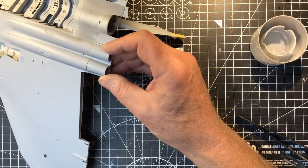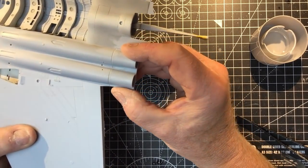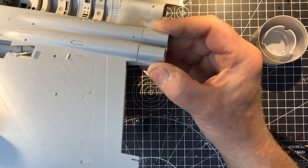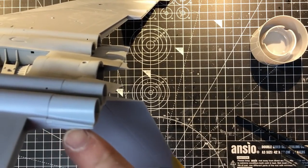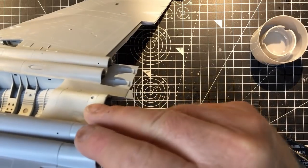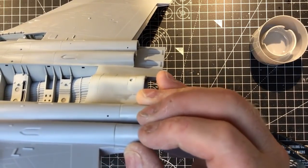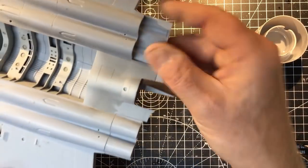And what I'm going to have to do, I think, with it once I've painted it, is just adjust the height, just to minimize the amount of sanding that I have to do. So it involves lifting it up a little bit. It might need shimming on the inside face here, but there's enough of a glue surface at the front edge to get a good bond. But I might just reinforce it and put some shim material in there just to get it nice and level.